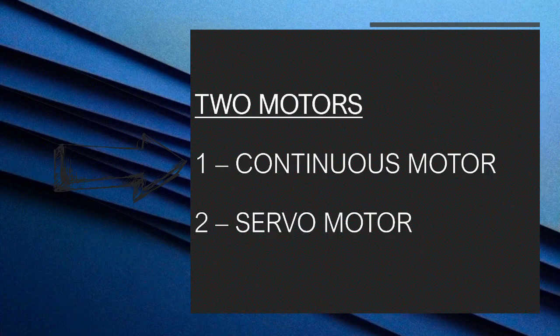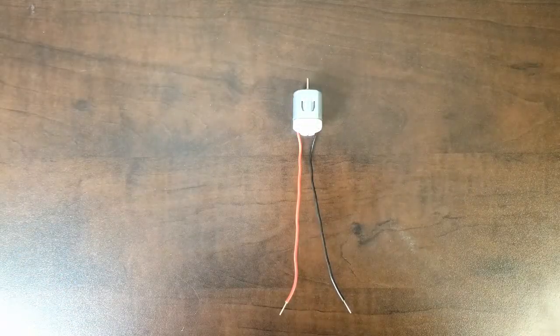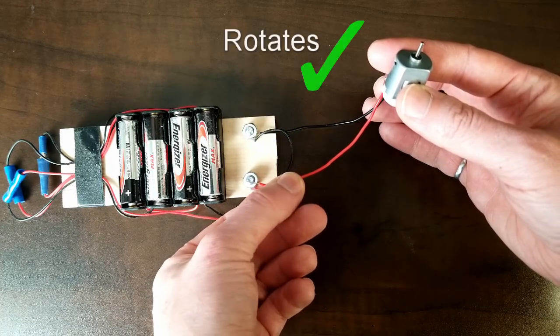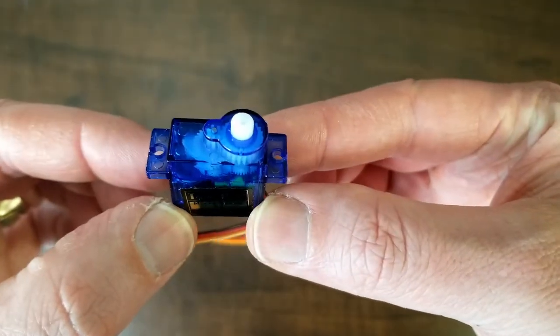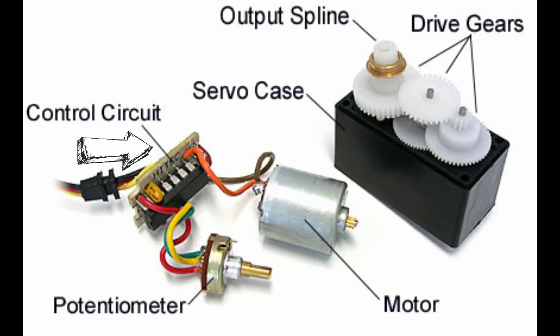So let's contrast two kinds of motors you'd see in hobby projects. First we have a continuous DC motor which will run continuously as you apply a voltage. Second we have a servo motor which will move through an arc and will hold its position in that arc based on the signal applied. A servo is really a continuous motor driven by a controller with a potentiometer to record its position in the arc and gearing to slow the output.